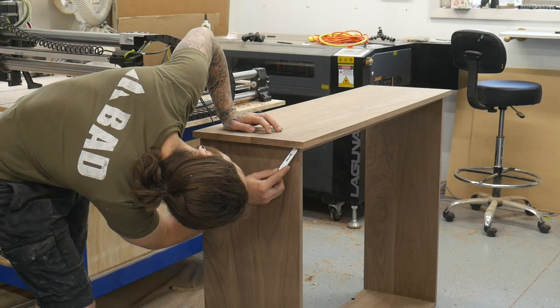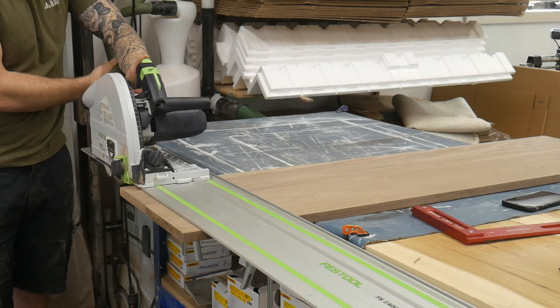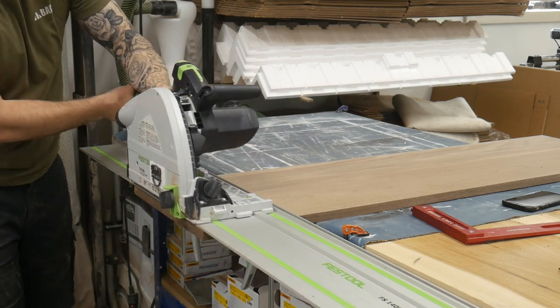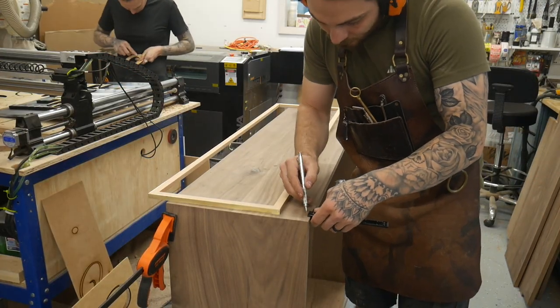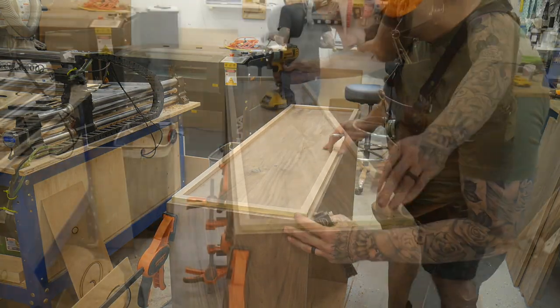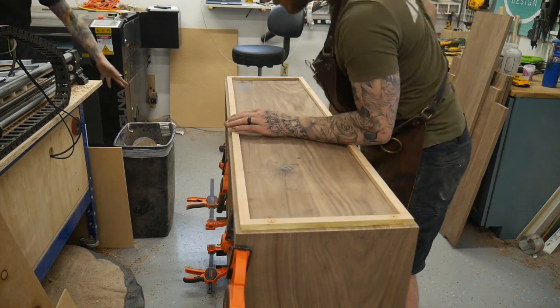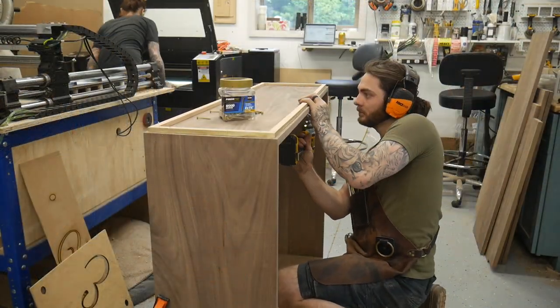And this is where the floating aspect will start making sense. This is just the top where the piece will get wedged — that's the copper part. Since these are thin strips of wood they did have some flex, so I ran a straight line here as a reference point for when I attach it so it's not bowed. I drilled pilot holes to ensure everything lined up straight, then just used screws to attach it — the easiest way I could think of.